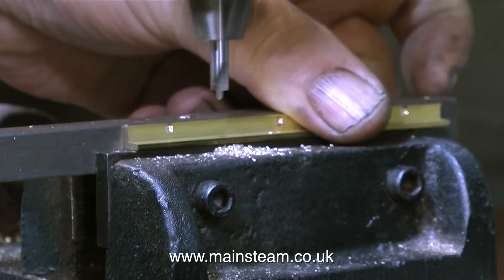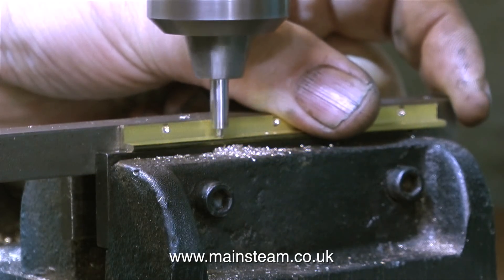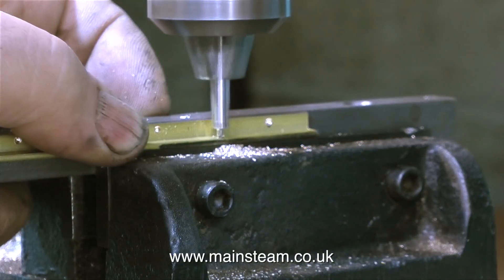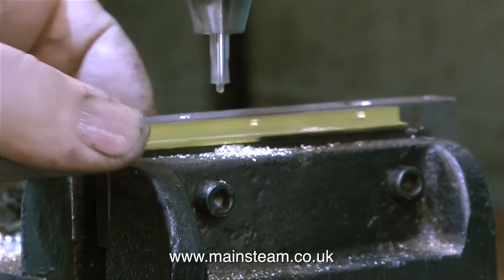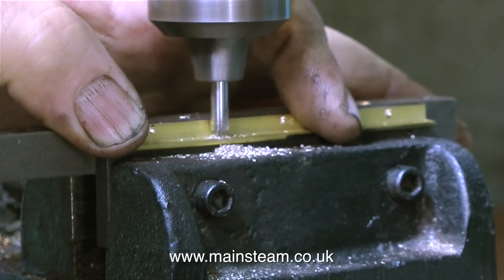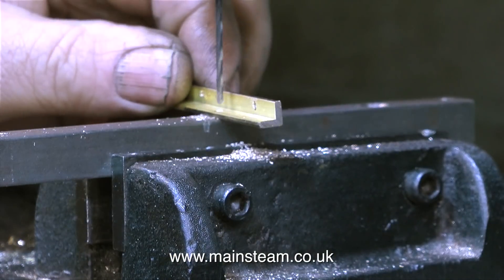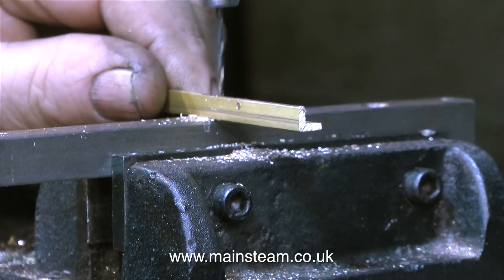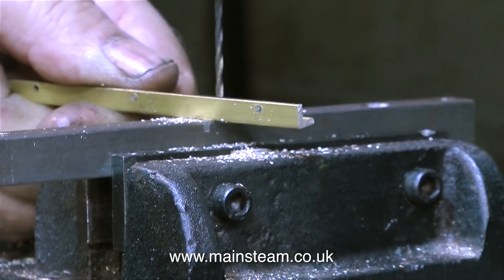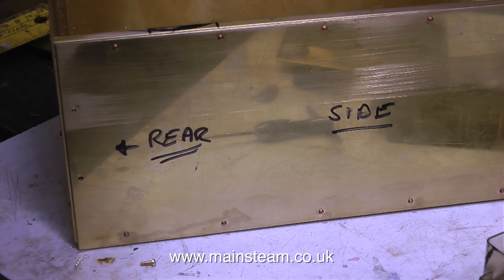This water tank is not a precision piece of engineering, it doesn't need to be. That doesn't mean I'm going to make a bad job of it — it's just that marking out using a felt tip pen obviously is not 100% accurate. Often I do use a felt tip pen for marking the metal before scribing a line on the black ink, just makes it easier to see because I don't have any engineers blue. Also, by using a felt tip pen there's less chance of me writing on my hand. I have enough black paint residue on my hands without adding engineers blue to the list.